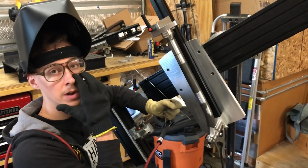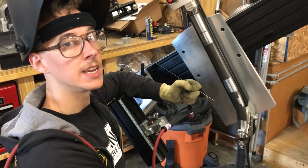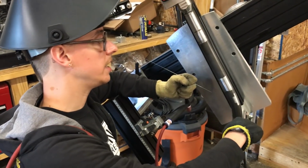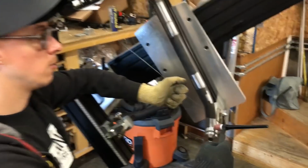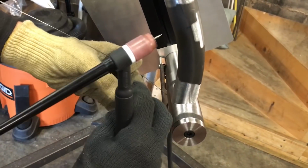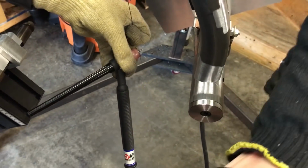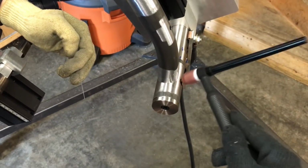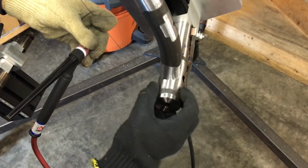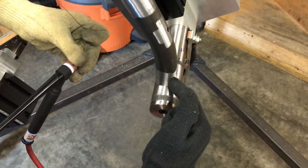And so what I'm always thinking about when I'm welding stuff is that this is heavier wall thickness on the bottom bracket shell, and when I put heat here, it can dissipate this direction and this direction on that tube. If I'm coming in right here with some heat, that heat in this tube can dissipate this way and it can dissipate this way. And at the end of this tube, when I put heat in here, it can dissipate this way, and that's it. So when I'm thinking about which one I want to heat up more, where do I want to put the heat? This is a heat gun, you're aiming the heat. I want to bias it toward this bottom bracket shell. This I know can absorb a lot more heat. This is the one that is going to burn through if one of them is going to burn a hole.